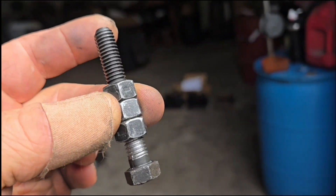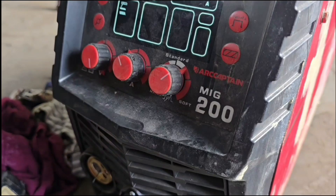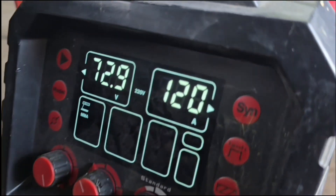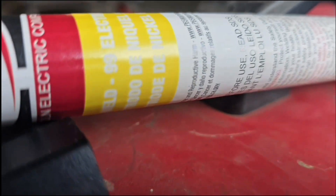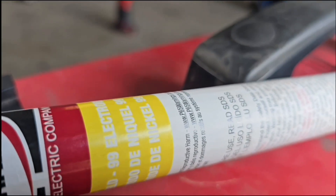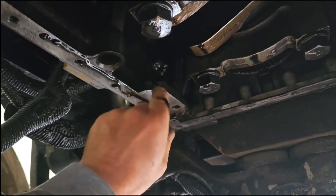So plan B — what we got here is a bolt that runs threads all the way down the shoulder, damn near to the head. Got the Arc Captain MIG 200 on 120 amps and 1/8 inch nickel rod, really good for welding cast iron like this Caterpillar engine block is made out of. Here's how we're fixing to get it done.